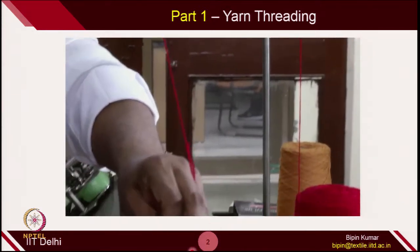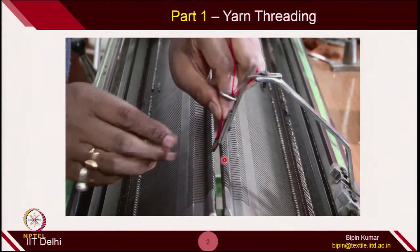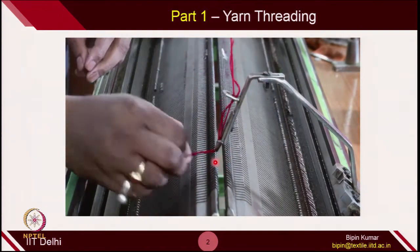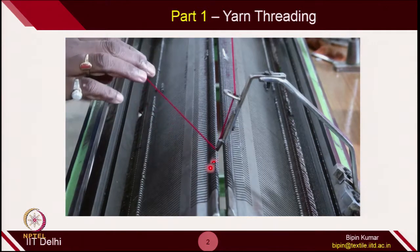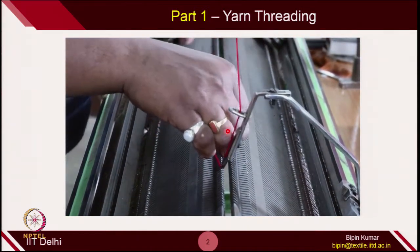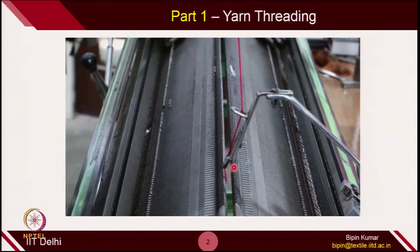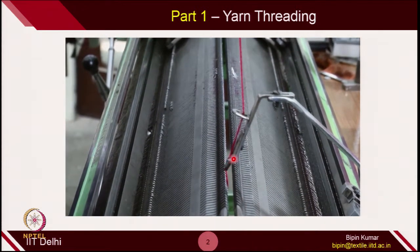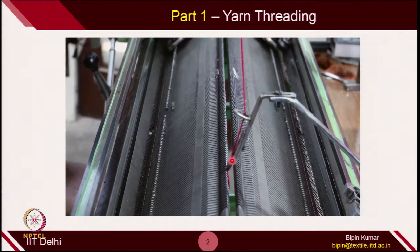After that another guide, and then the yarn is supplied to the feeder zone. This is the feeder zone — the first guide and this is actually the feeder hole. We supply the yarn to the feeder hole. Once the yarn has been passed to all positions, the yarn is then passed from the center of these 2 beds and held from the bottom side. The feeder is now carrying the yarn and will supply it to the needles on both beds.